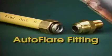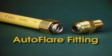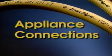It is obvious why AutoFlare can give you the competitive edge in flexible gas piping installations. Making appliance connections with TracPipe is fast and easy, designed to get you in and out of a job more efficiently and profitably. Direct connections can be made to fixed appliances as long as the appliance is located in a mechanical room, basement, or garage.